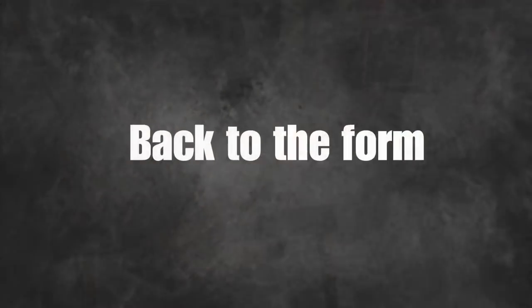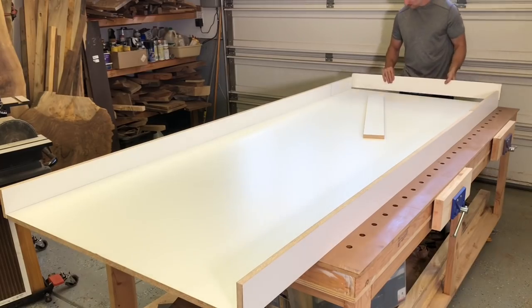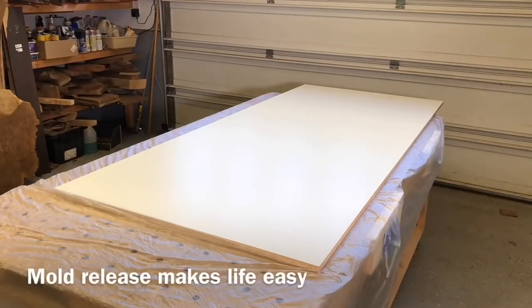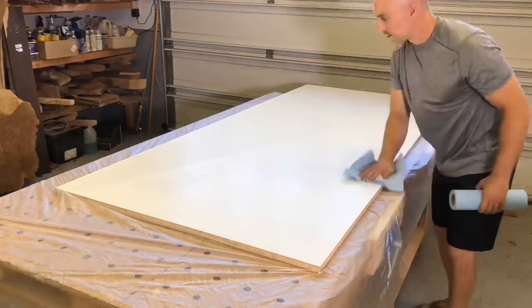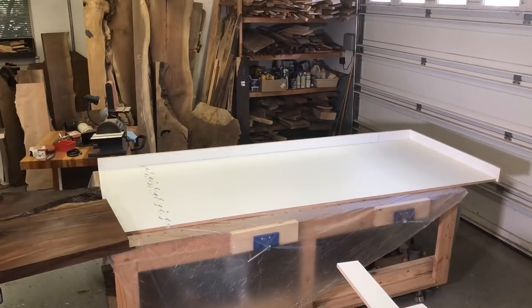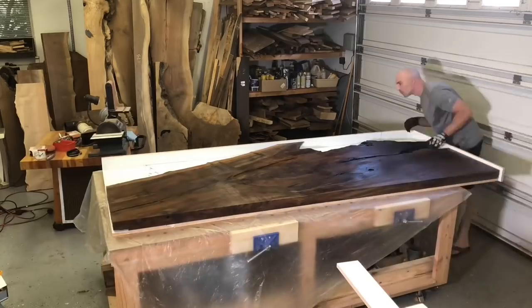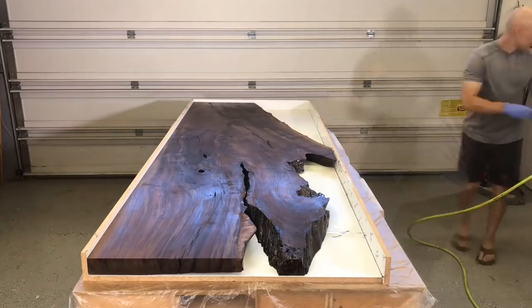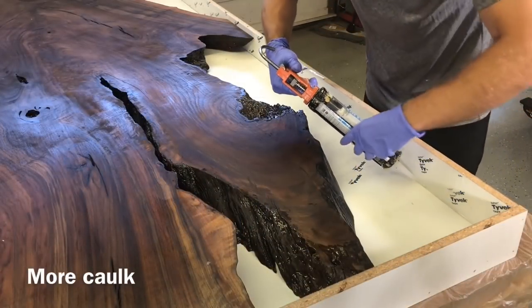Back to the form: I make the sides about an inch taller than the overall thickness of the entire table, so you don't have to worry about any of it spilling over the top. Anybody who's done enough of these tables has had a leak, so that's why I'm putting plastic down. This mold release is absolutely clutch — don't skip this. Some people use tape and I've done that before, but the mold release works just as well and it's a lot easier. Since I was by myself I had to build the form around the slab. I use fast-drying caulk — don't use silicone, I made that mistake on this table — it makes the sides really hard to get off. That 20-minute caulk is my go-to.